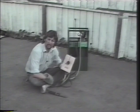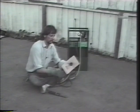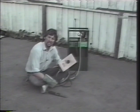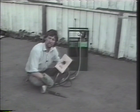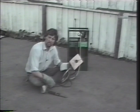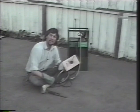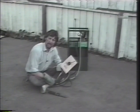Suppose you had a hostage situation, somebody inside a brick or cinder building. You wanted to get a viewing device or a rifle barrel through a hole quietly. Light the torch, stand outside, poke through. Measure the time it takes to go through the same kind of brick or same kind of cinder. The last 1/4 inch, stop, pull it out, put a chisel in, tap a hole in. You've just about silently punched a hole in any building known to man.